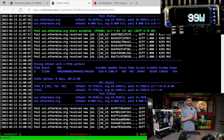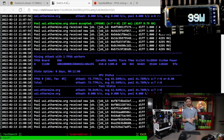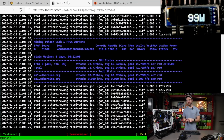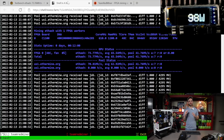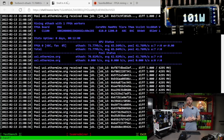Measured in-line over PCIe, that is 73.77 megahash for 100 watts — that is insane, that is crazy efficient. One thing to call out: the fan is externally powered from the power supply so that's not being counted in the power reading you see, but even so, what amazing performance on this FPGA.